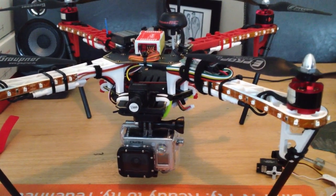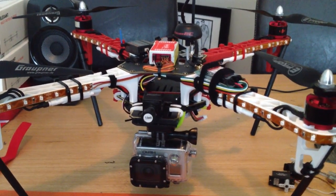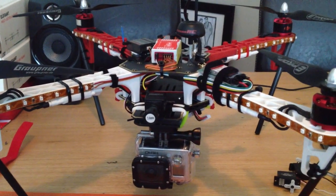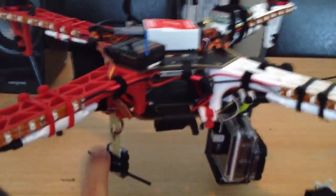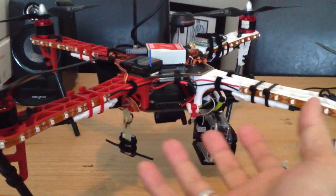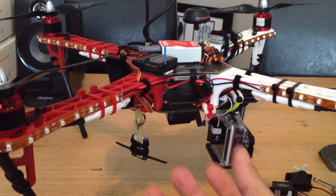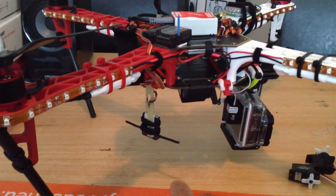I did want to improve on the results from my previous video, which wasn't spectacular. I read a fantastic article, which I'll link in the description, that teaches you a bit more about receiver and satellite placement in terms of aerials. The main dramatic improvement I had was from placing this satellite down away from the body of the electronics. This F450 is quite small and compact — everything's very close together — so you want to get it away from the other electronics and RF noise. This has shown great improvement in the range.